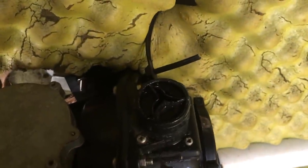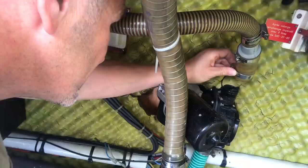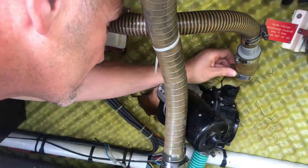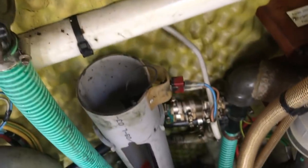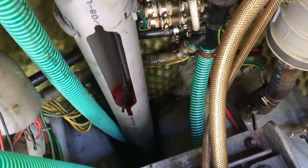Actually there's another non-return valve in there and it's wide open, so that's probably part of the problem as well. I think collectively, with the non-return valve in the strumbox and the non-return valve in the pump, the water is probably draining back down into the bilge.